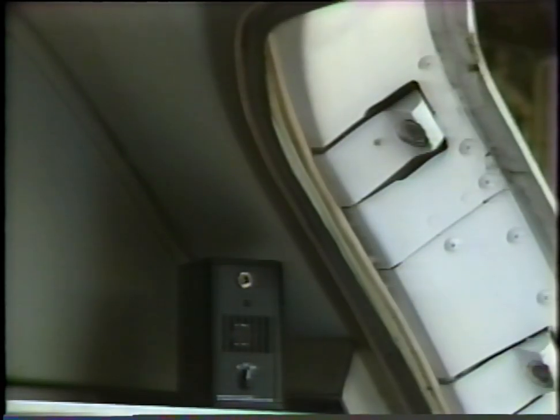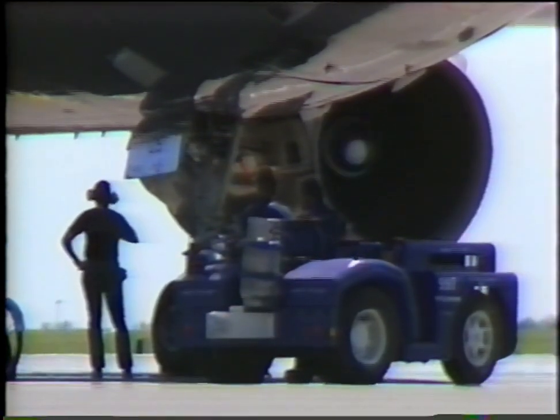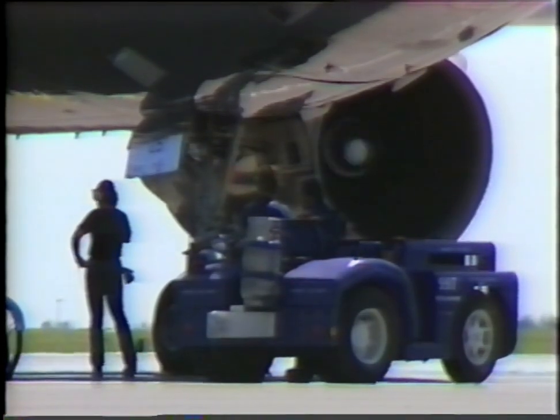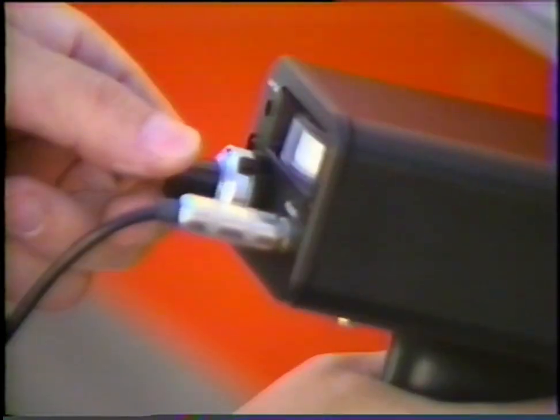Cabin pressurization can be checked by utilizing the tone generator with the Ultraprobe. Place the tone generator inside the aircraft at a designated door or window. Pressurize and maintain that pressure. Outside the aircraft, scan the entire door or window. You will hear the warble tone generator. Using the headset and reading the meter, identify significant leaks.